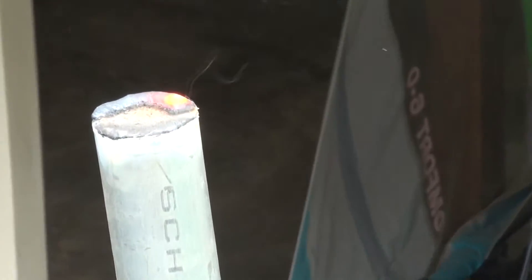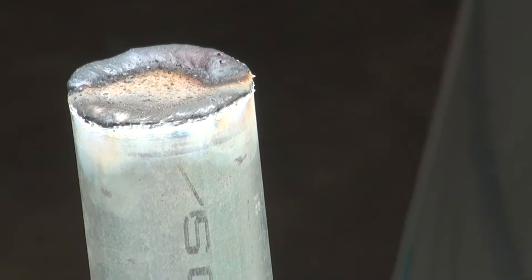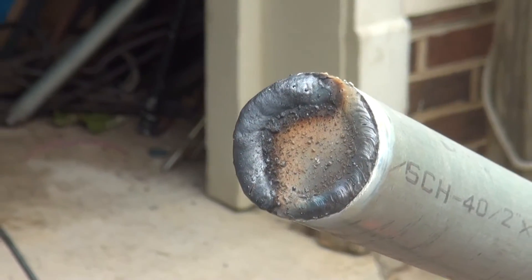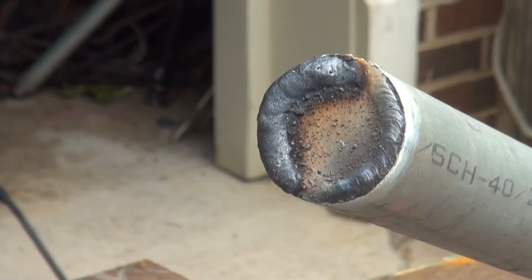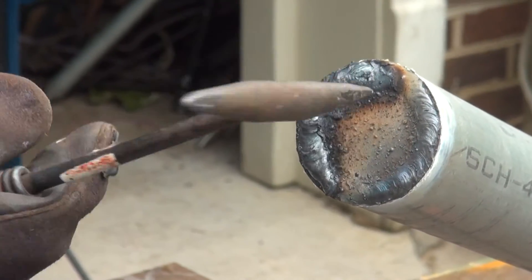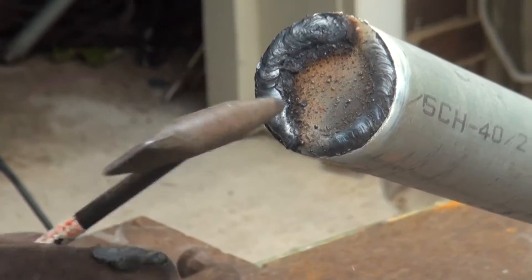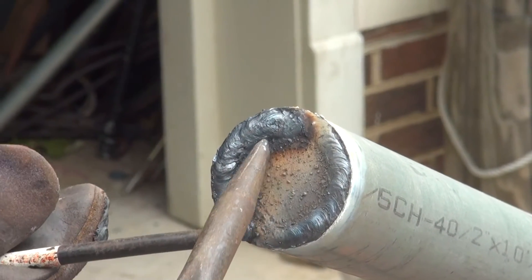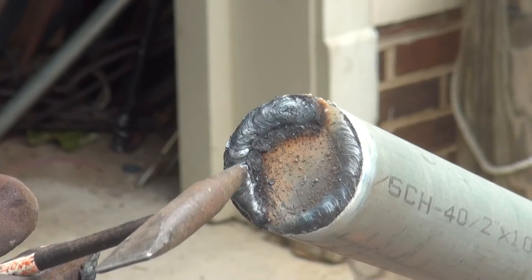There we go, and that'll do it. See the little heat waves? So there's the first weld right there, and then there's where we went over with the second one just now. So I'll chip that away. That weld there has a nice flow. This one here is a little bit cold right there, but it's over a spot that was okay, so I'm just going to grind that down. This is the area I was trying to fix.